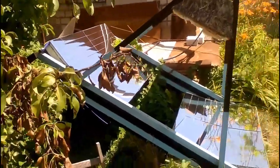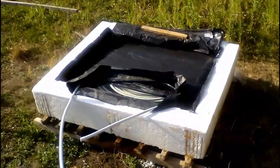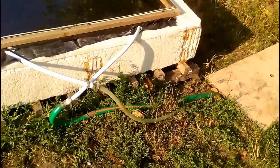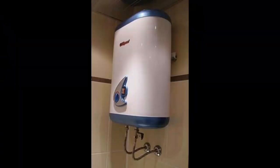My old system required periodic additions of cold water to this tank in my attic, and now I open this tap to add the cold water. But I remind you that my new system has this white pipe, and the inlet of the pipe connects to the cold water supply of the house through this hose. At the same time, this hose goes from the pipe outlet here, and this place is intended for a similar electric heater, and these tubes must connect to these two pipes.